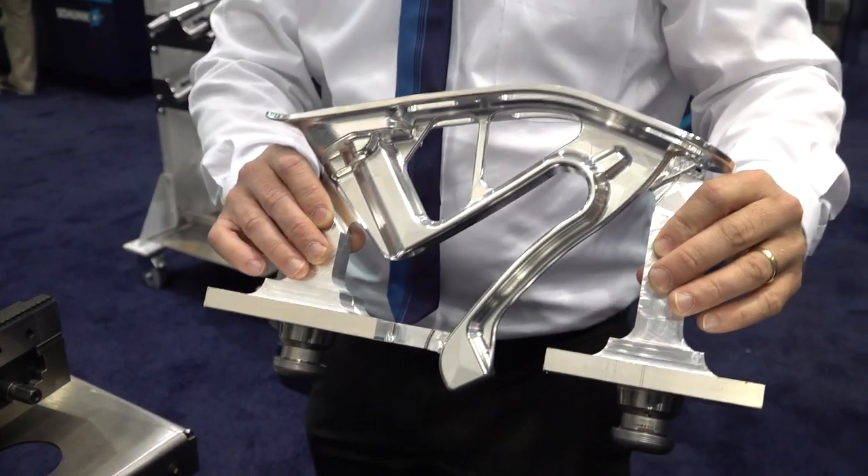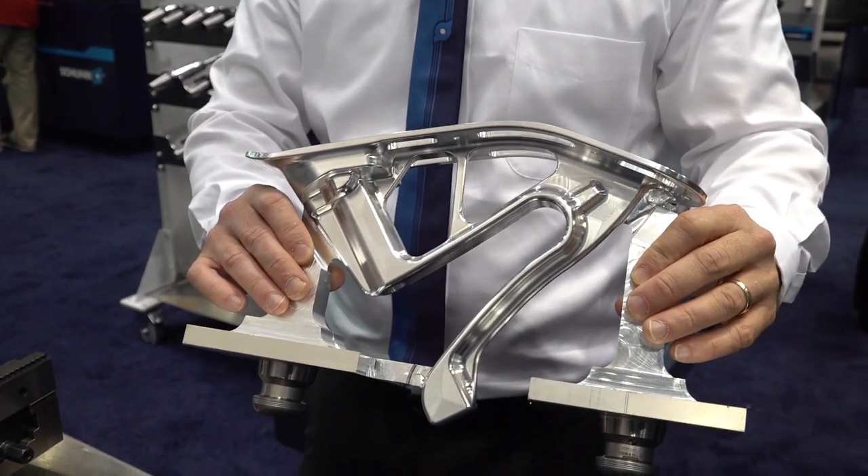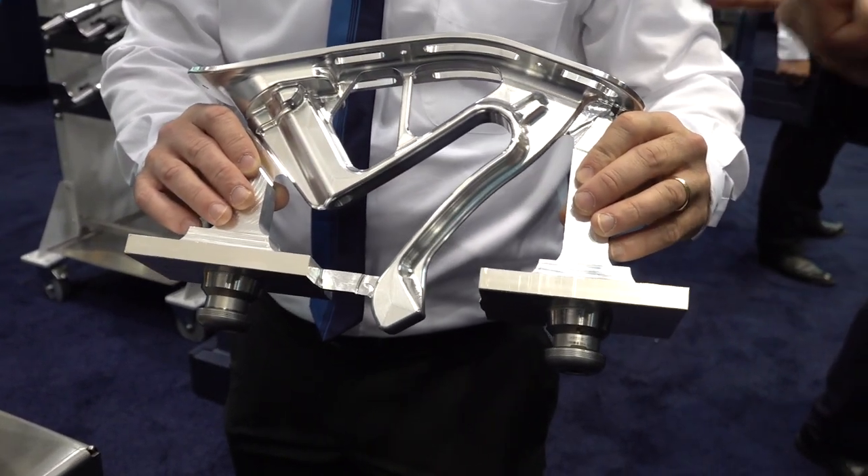I think most importantly, you really just have to think about your work holding. Many times people get the machine tool before even thinking about work holding, and then the part shows up and they need to manufacture it. But take it even a step further and have your designers consider how the part can be made — especially the more complicated ones. If they can incorporate some sort of tooling into dead spaces of the part, have that incorporated in. It makes it a lot easier to clamp. Think about work holding when you design your next part.